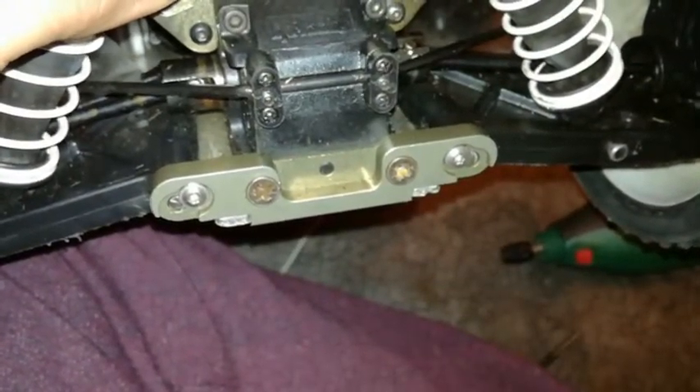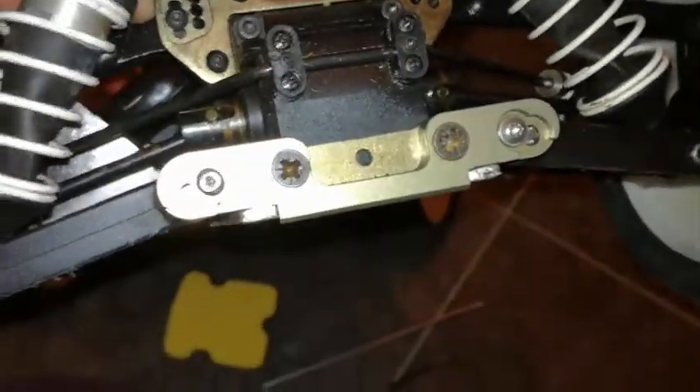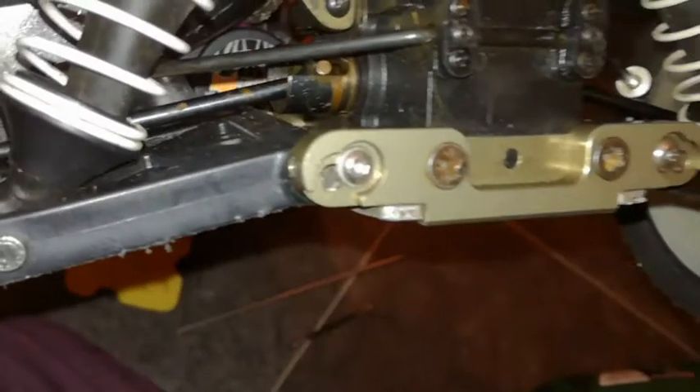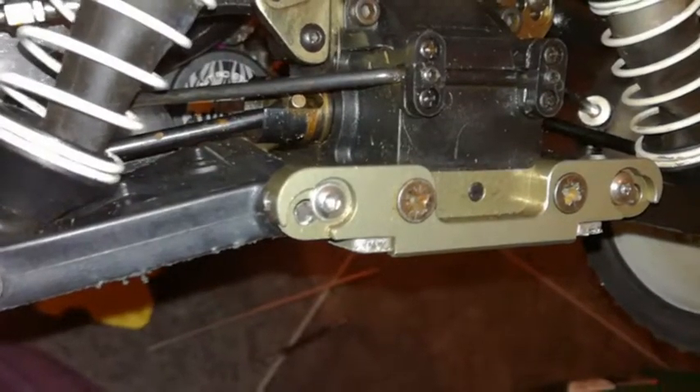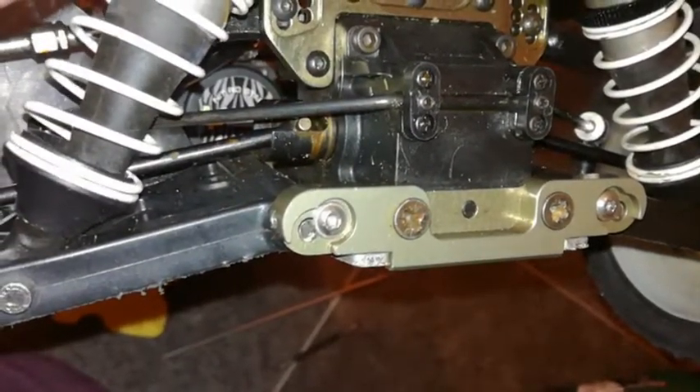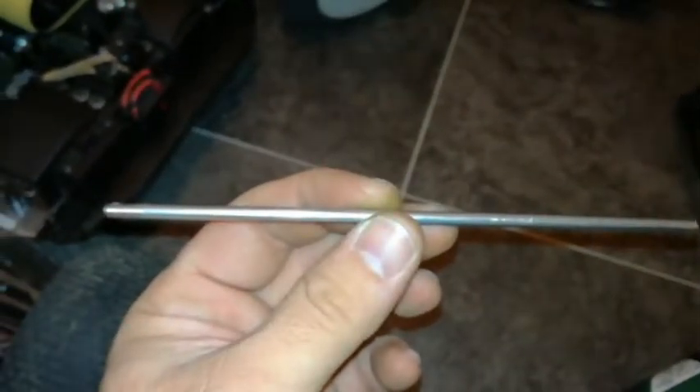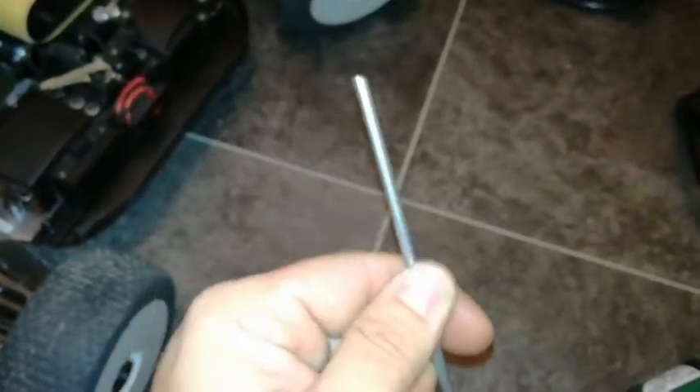The two pins — I've already replaced them. I was going to do a video about the manufacturing of them. As you can see, there they are with the little retaining screws. Those retaining screws are just flanged button head screws with an Allen head socket on top. What I bought was a 30cm bar from abroad — it's a 4mm bar, 4mm by 30cm originally. I tried to thread it; I put an M5 thread on it, which was obviously too big.